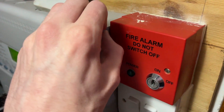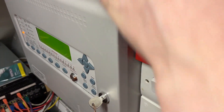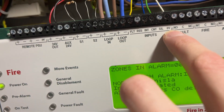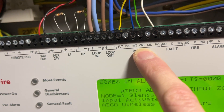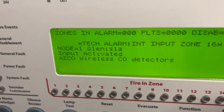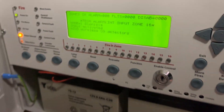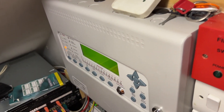Just quickly show you — the cable here comes from the panel interface module and goes into these terminals here. The relays connect zero volts to any of these inputs. This is your common — if you connect that to continuous, you'll get the full evacuation. If you connect that to intermediate or intermittent, you'll get the intermittent tone, which I've selected to give the 'in the interest of safety' message. We've also got a fault contact relay which activates when you take the echo sensor off its base and broadcasts a fault signal, which triggers this into fault.